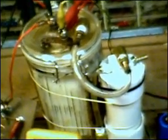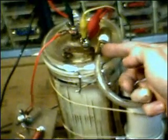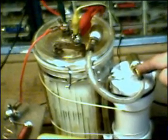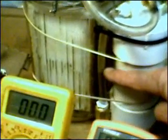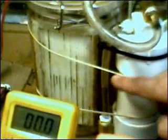After doing so, I had a real problem with foaming inside the canister. The foam was actually rising up through the tank, right up to the top of the lid, coming out, pushing out the tube and into the bubbler. It was losing quite a bit of electrolyte that way, pushing a lot of the fluid right down the tube into the bubbler. And the level indicator of the bubbler would actually rise with all the additional fluid getting trapped in it.